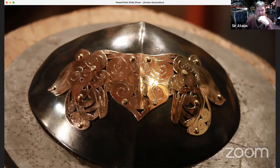So hopefully a couple of helpful notes. Escutcheon pins at a hardware store: make sure they're solid brass and not plated, because plated just means they're steel that has been given a veneer of brass. When it's gone, it'll rust in the steel rust way, rather than just patina.